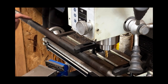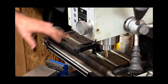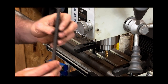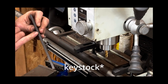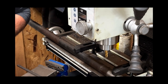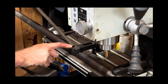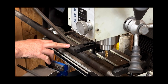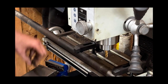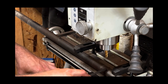The key slot is probably about 3/8 deep and this other one is probably a quarter. What came out of it — hopefully you can see that — I don't believe this is an actual keyway because it's quite rusty and has this line, which could actually be chatter because it's very sloppy in here. I went ahead and bought new key stock which fits in here perfectly — a nice tight fit. If this isn't as deep a shoulder as this key stock, I may need to mill it down to accept the gearbox to slide in. That should stiffen everything up. Now we're just going to mill this slot just a little bit — probably another inch.